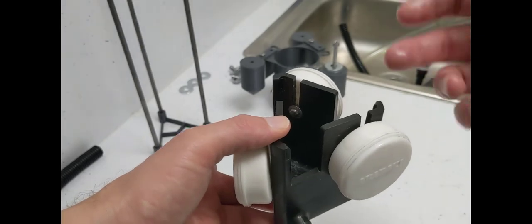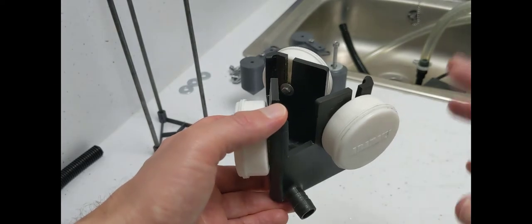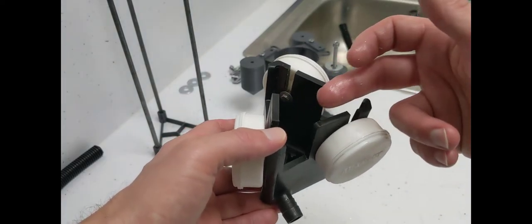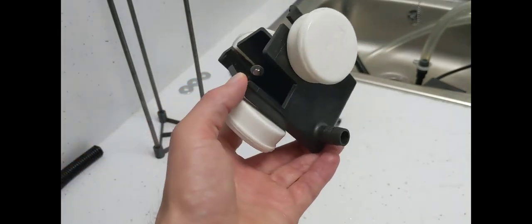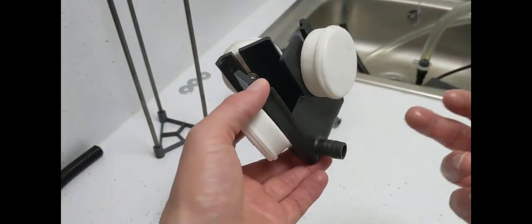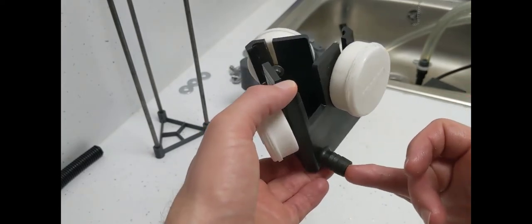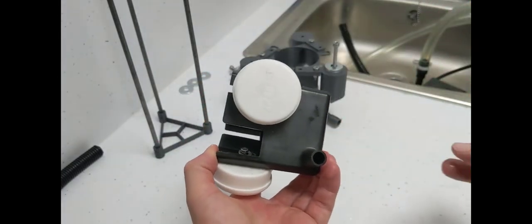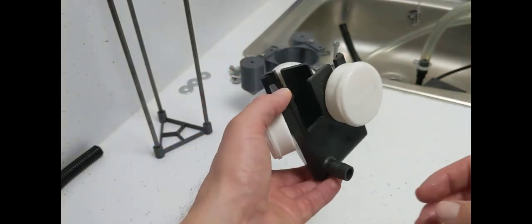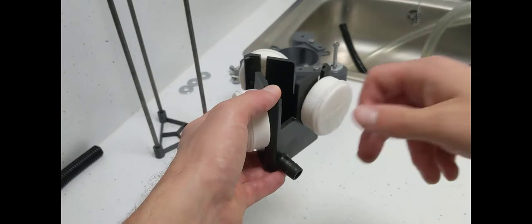Even when it's freshly cleaned with no oil in it — and oil is quite a heavy liquid, so it's harder to move — you need a strong vortex to draw it down. Even fresh in the tank you don't get a strong vortex and it struggles to get liquid off the surface. The outlet to the pump being on the side is another problem: with a vortex you want it going straight down the middle with the outlet coming out the bottom, so the vortex goes straight down.